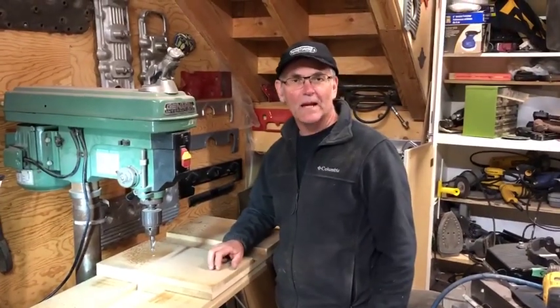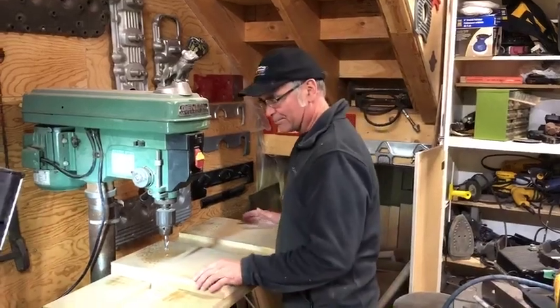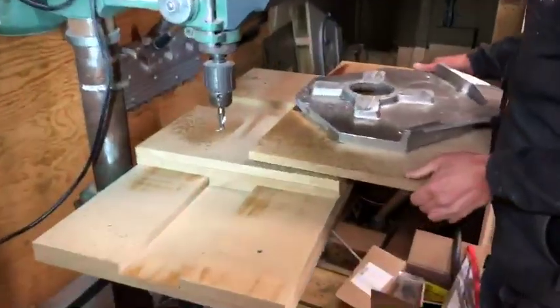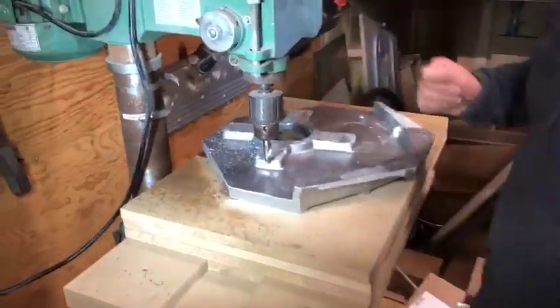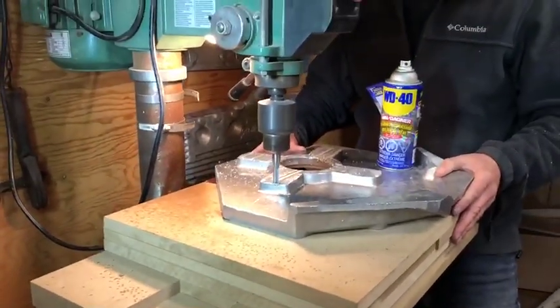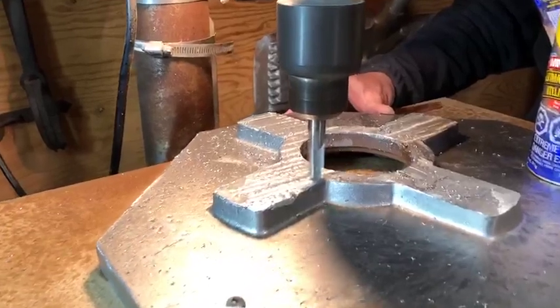Just like you're doing woodwork. I've got to do some machining on my back plate here, my aluminum plate, and I don't have a milling machine. So I thought, how am I going to make this work? I kind of built my own. This slides this way, and I bolted the back piece onto this slide, and then this will slide like this. I put a milling blade in my drill press, and let's just fire this baby up. What do you know? It works.